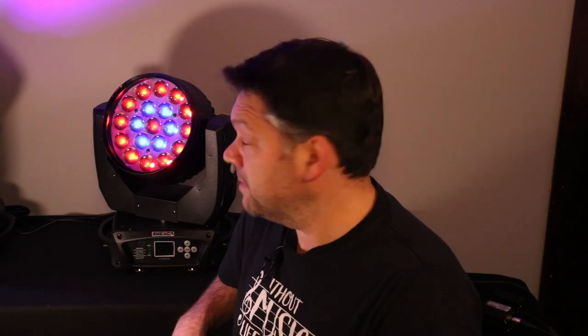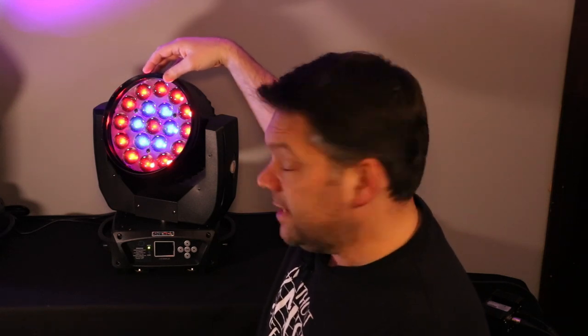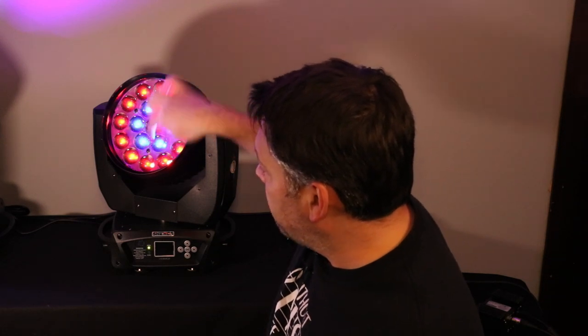What do you think of that? I'm going to show it to you on the opposite wall in just a moment. I also want to let you know that this runs in 16 and 24 channel DMX. The big difference is that in 24 channel, you can control your red, green, blue, white LEDs from the center ring to the outside ring to the next ring — three rings total. You can control them independently, so you can actually make it chase if you wanted to.